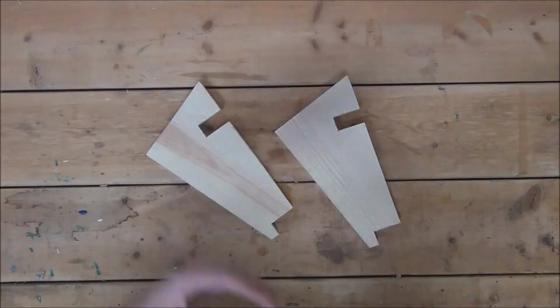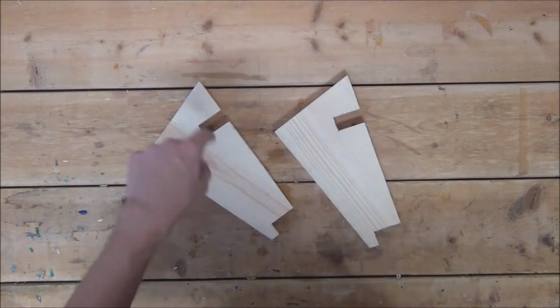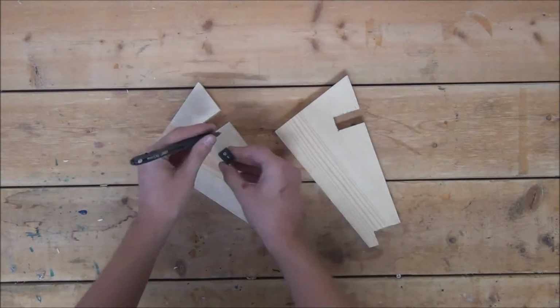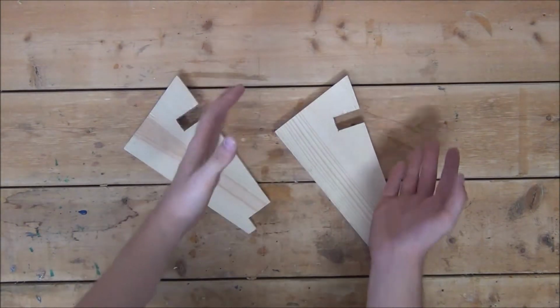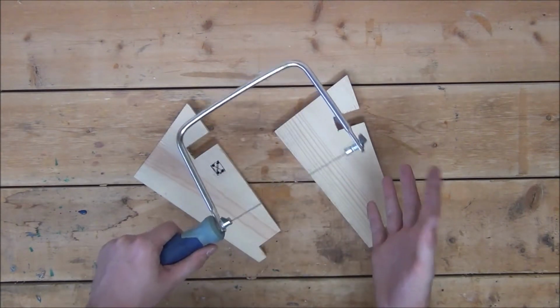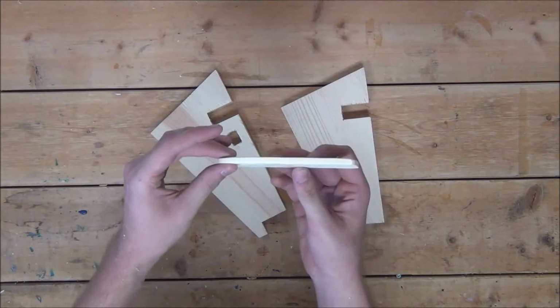Now we're going to want to cut out a small hole for a power switch to fit in. It doesn't really matter where or even what side you mount the switch on, but I'm going to mount mine right by the back post on the left side. To make the hole, I'm simply going to trace around the switch right where I want it to sit, drill out the 4 corners, then slide my coping saw blade into one of the holes to finish the job. Just like that.